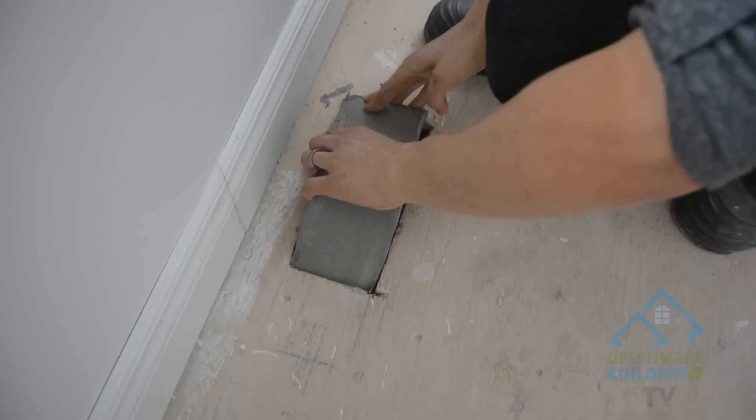The first thing we do is go around and seal all the ducts with this foam — stick the piece in here — that gets a good seal so we can get that pressure up nice and high to see what our rating is really going to be. Gary's just throwing the sealant in right now. We're going to fire this up and watch it work.